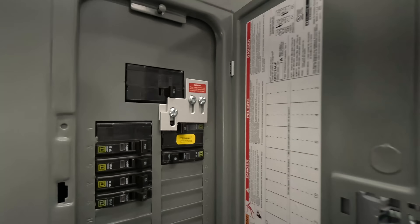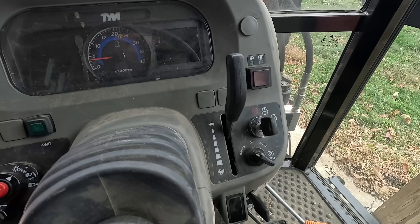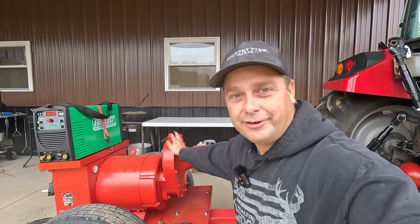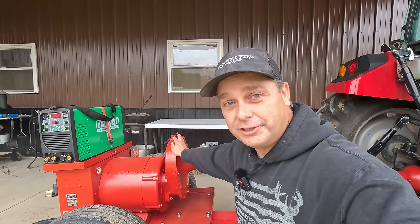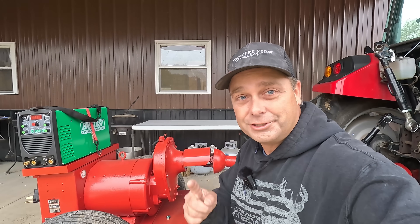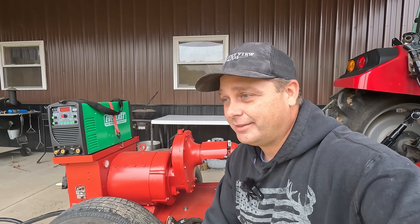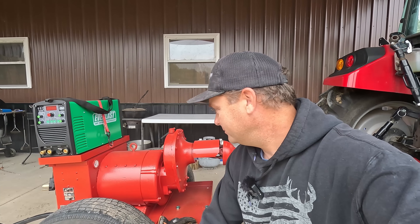That's pretty good. I think that was a fairly good test — it definitely powers up almost everything in the house. I'm going to switch back, turn the generator off, and turn the main breaker on. We set out today to find out whether this old generator bought at auction would power the house. It won't work on the small tractor with clean usable power, but with the big tractor we got a full 50 amps powering pretty much all the big loads. This generator was not a waste of money.